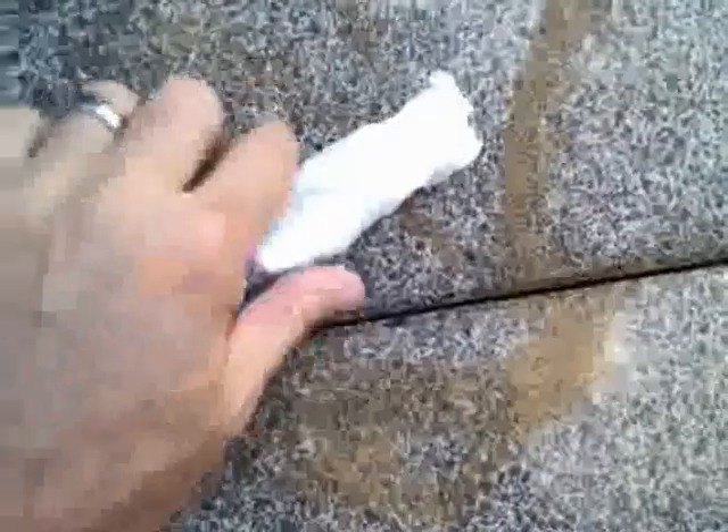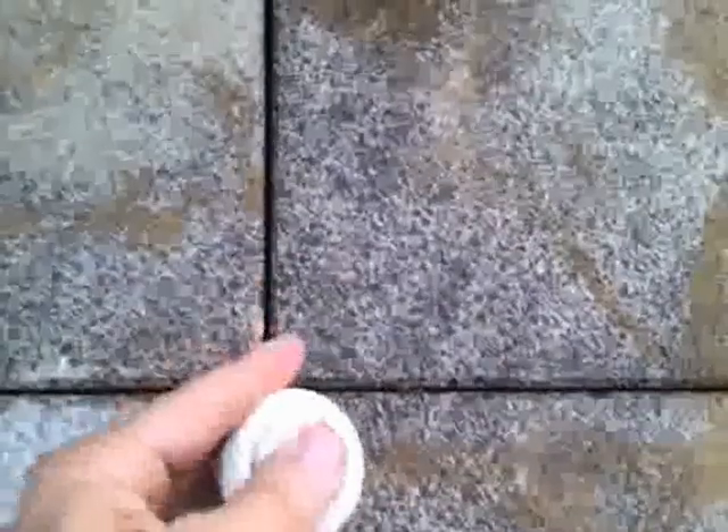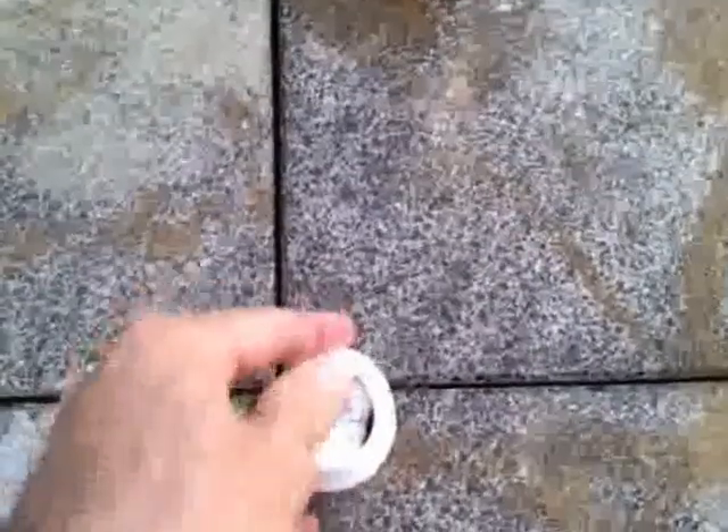You know you aren't recycling this — you'd be throwing this stuff away, right? But I'm not going to throw it away. I'm going to try to figure out how to make it into a hydrogen generator. I'm making these sandwiches of aluminum foil and paper towel, and then we'll wet them and put the sodium hydroxide on them, crush it so I can fit it inside the pill bottle. The paper towel will keep the sodium hydroxide next to the aluminum in the sandwich, and that increases the surface area, which should make the reaction proceed a lot faster.